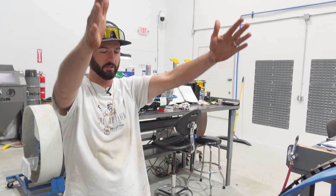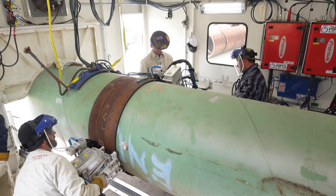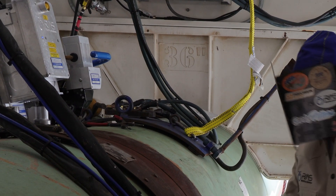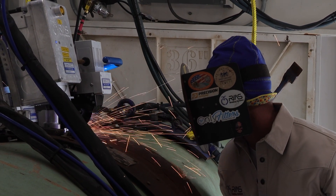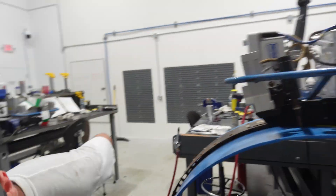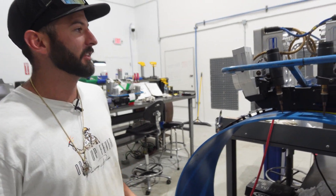The shack's going down on a piece of pipe. Helpers run in, drop the floors down, they grab the bug off the wall, throw it on the pipe, and get it to the top where it needs to be. The welder comes in, looks down at the bevels, makes sure it's centered — center pin cycle — then arc start, give it a second to purge the gas, then you're going. You're just watching it, making sure it's where it's at. Sometimes you might not even have to touch it at all. If you've got it set up right, you just watch it all the way to the bottom, hit stop. The welder sets the pendant down and walks out.